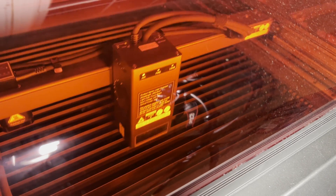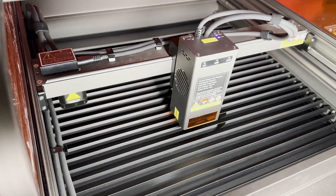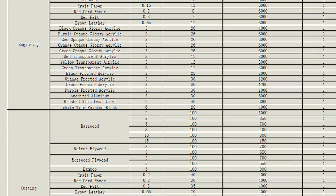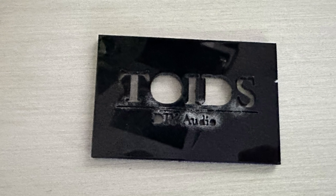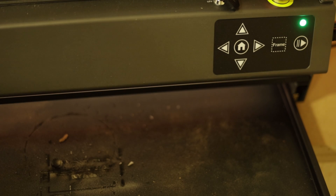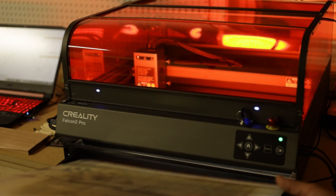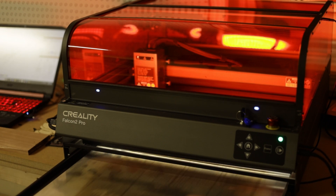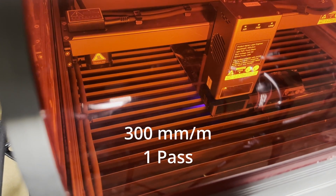It was time to cut my most common materials to see how much better the 40 watt is compared to my 22 watt of the same laser. First up was acrylic. Creality provides a chart with suggested feed and speed settings, but running their settings it was too slow and burned the acrylic a little — I just wasn't happy with it. I also noticed it started cutting through the bottom drawer, so I put a piece of scrap metal and an old honeycomb inside the drawer to protect it. Once I sped things up, it cut the acrylic perfectly.